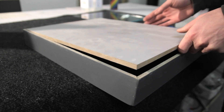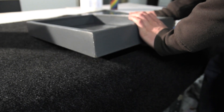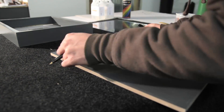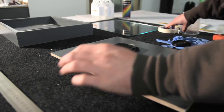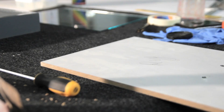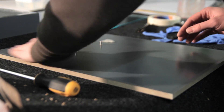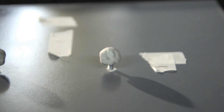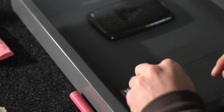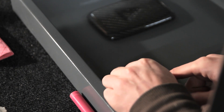I removed the flange. This section is a bit about the box — I'm not a woodworker but I made it myself. If you want to see videos about woodworking, check out DiResta and 'I Like to Make Stuff' — I'll add links in the description. I'm measuring out the center to apply the piece, putting two bolts through the wooden back. Little secret: I use some tacky tape on the bolts to level it up a bit from the backing plate. Not very professional, but it works.